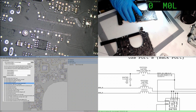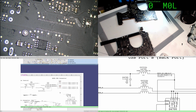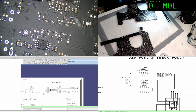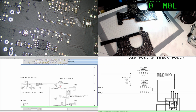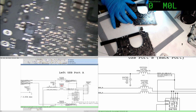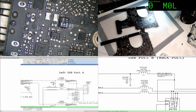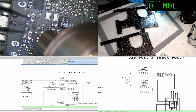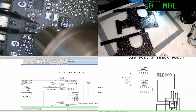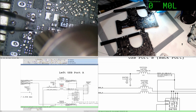Thank you very much. Let's just bring that up and have a confirmation of that. Oh, it's on the serial ATA connector, optical drive connector too. Optical drive, and yep, there we go. It's on the USB ports. So yes, the 2915 once again serves a fine purpose of being a good donor for many parts, even though it's useless on the GPU side. Interesting that it's on the optical drive as well, so good to know.